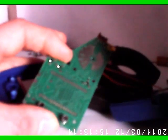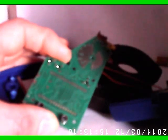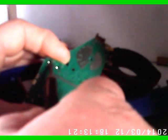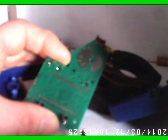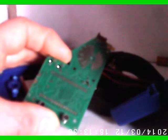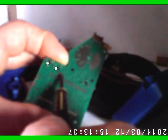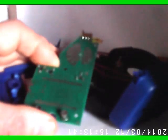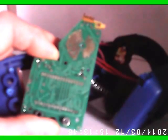I've already looked at the circuit board closely and noticed that the little trimmer resistors on the other side — there's one here, one here, and one over here — each one of them has one pin that's not soldered. But it's not connected to anything, so I guess it really doesn't need to be soldered. However, this one over here: the pin that's not going anywhere is soldered and the wiper is soldered, but the tail end of the other contact is not soldered.